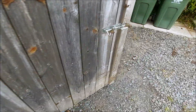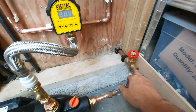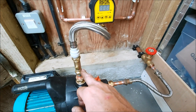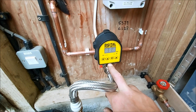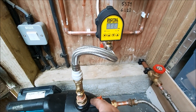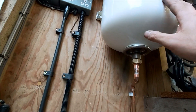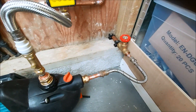I've been working on my pumped rainwater tap - there's the tap through the workshop. The water from the rainwater butts is going to come in here into a pump, which will pump the water through a non-return valve so the pressure that builds up in the system can't return back. We have a non-return valve, then through a pressure switch which I've set at three and a half bar - once the pressure gets up to three and a half bar the pump shuts off. Coming up here I've got a pressure vessel, so once it's pumped up and you open your tap you've got pressurised water. When the pressure drops to about two and a half bar the pump kicks back in.